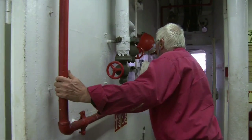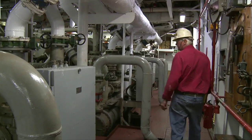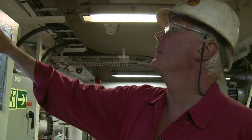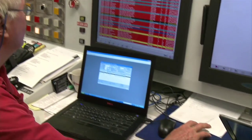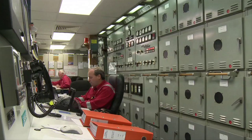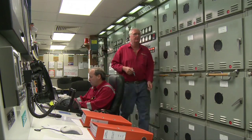My name is Charlie Wynn. I'm second engineer on board the JOIDES Resolution. My job entails keeping the electrical and engine plant running at all times to produce power, not only for the accommodation, but for the drilling package and propulsion. We have to keep an eye on all the engines and temperatures. We also generate all the water for the ship — the ship uses approximately 40 to 50 tons a day. All the systems are monitored and have alarms on them for pressures and temperatures, so we can find out if there's a problem before it happens and go to the pump and sort it out.